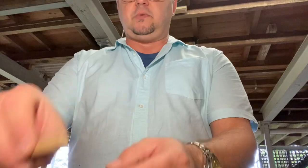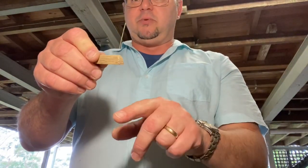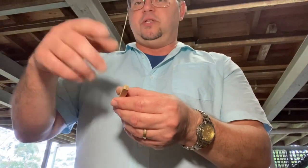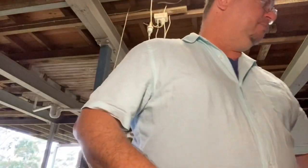And then that cable will go through the top of the Cigar Box guitar box into the cavity, and then you can earth it to the output jack or earth it to the volume pot, and so on and so forth. So that's that way. But we're not focusing on this today. We're actually focusing on the copper taping.